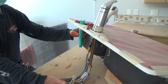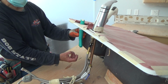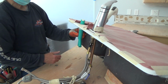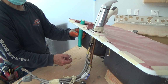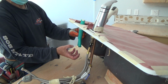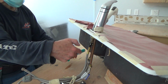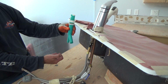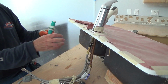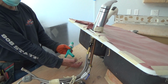And then when you get under there for your dishwasher or whatever, to make sure you've got a long enough pipe in case you want to cut it or something, you can hold it up there, you can mark it, take it down, or your long pipe, you know, that goes to your garbage disposal. You can attach the piece to the garbage disposal or whatever, and then you can hold the other piece up, mark it, take it back down, cut it, slide it all together, put it up, and you may have to tweak this pipe just a little bit, twist it a little bit in case you got it twisted the wrong way or whatever. And that way you can tighten up your clamps and everything down below.